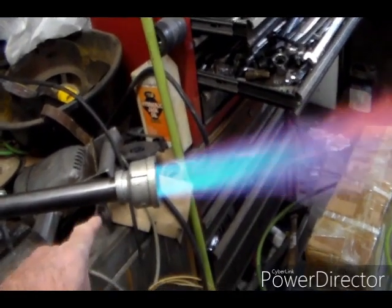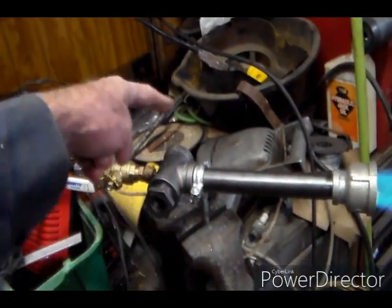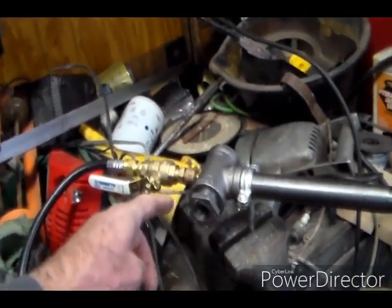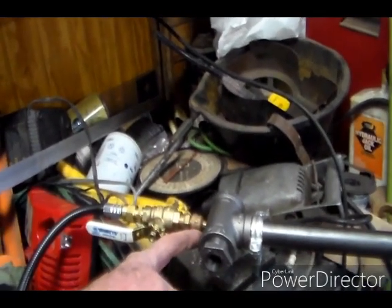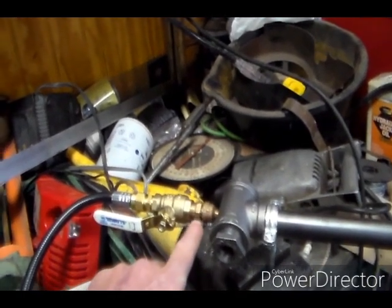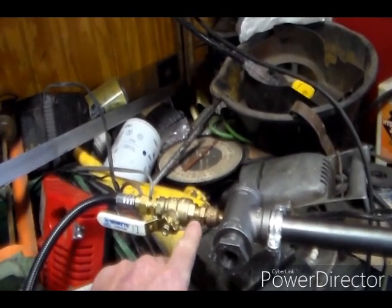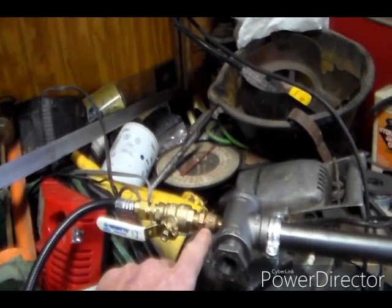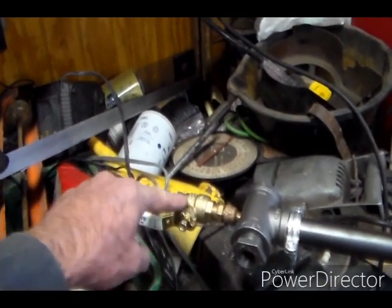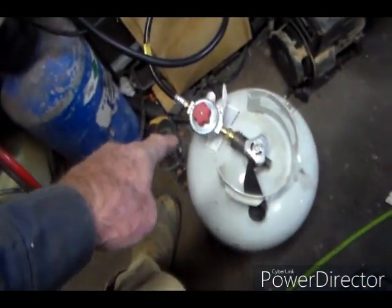1 1/4 to 3/4 bell, 8" by 3/4 nipple, 1 by 1 by 3/4 T with the 1 by 1/2 bushing, 1/8" pipe male to 1/4 pipe female bell, quarter female, quarter male, quarter-inch male ball valve, quarter male to quarter flare fitting, flare line down to 20 psi regulator.